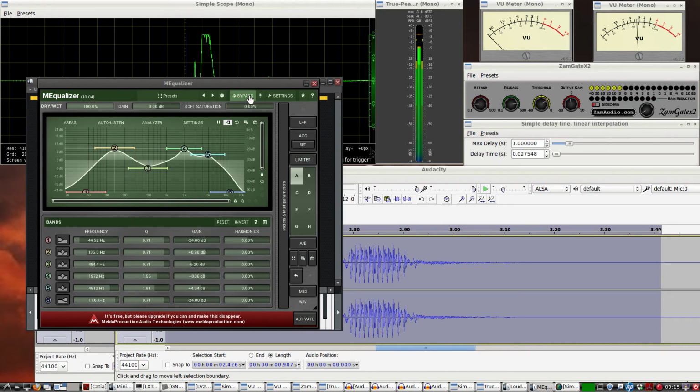So when I bring it back like this, we have a little peak around 2, a little bit between 4 and 5, and then everything else goes down. That also helps to get rid of some of those high frequencies that aren't really necessary for speech, and for some people, if they're too loud, the harsh sibilants can be irritating. And I'm not using a de-esser, so this helps a little bit. So again, my voice with it, and now my voice without it. So I prefer it like this.